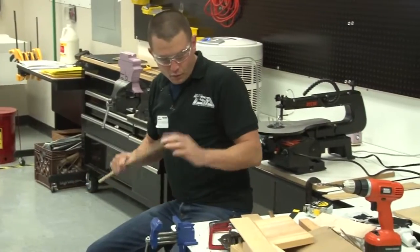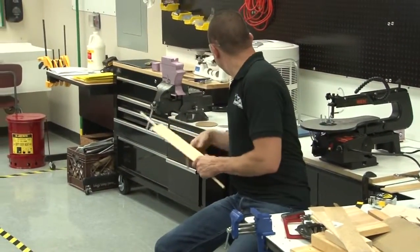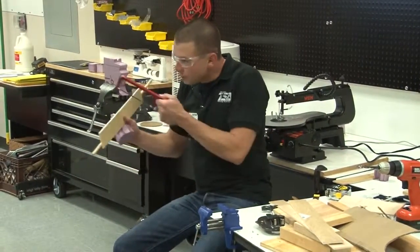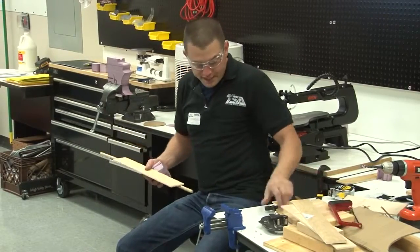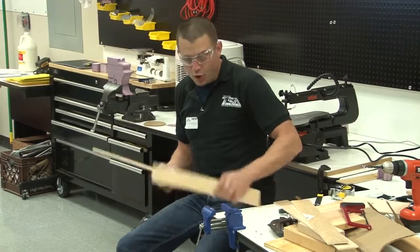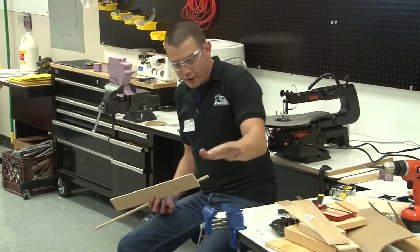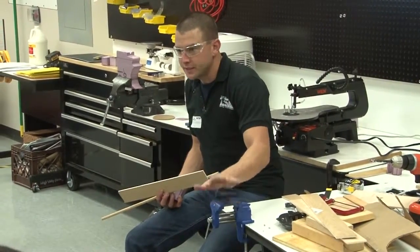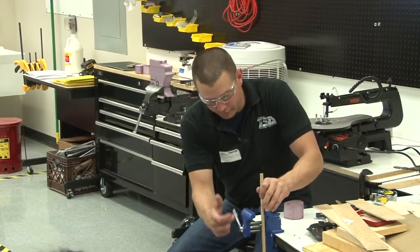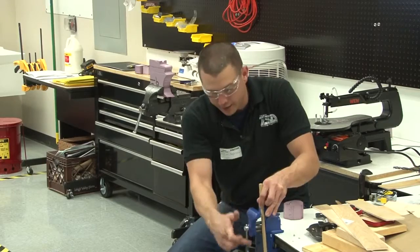Dowel rod. Whether it's a dowel rod, a piece of plywood, or a piece of styrofoam, we would never cut these in our lap or hold them up in the air and cut them. In fact, we wouldn't even hold them down to the table with our hand and cut them. For cutting with this blade, always put whatever you're working on inside this vise, or this bench vise up here. If I wanted to cut just a little bit off, I could turn it up like this, like you're saying, and